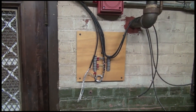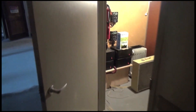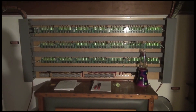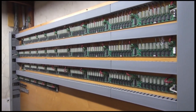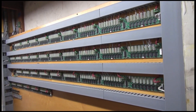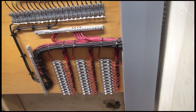If we take the left branch of the solid state, we come into the swell chamber here, and there are nice new power supplies, and there is the panel for basically the swell. Some divisions kind of cross over a little bit, but that's the solid state for the swell. And then down here through this door is the swell choir. You'll notice it's a really big panel because the swell choir is all unit action — all unit stops. There are a lot more individual magnets as opposed to straight stops with primaries. Nice neat grounding. Nice work.